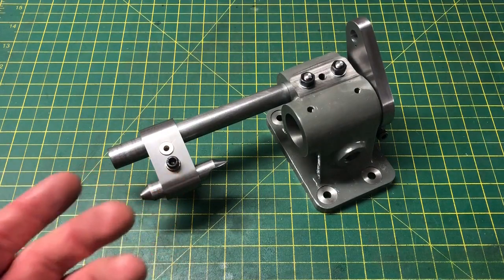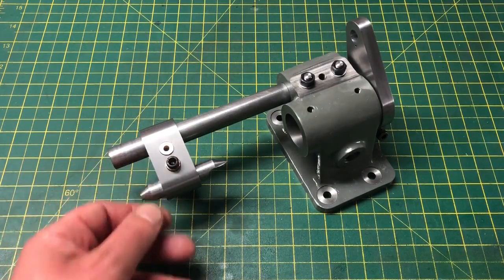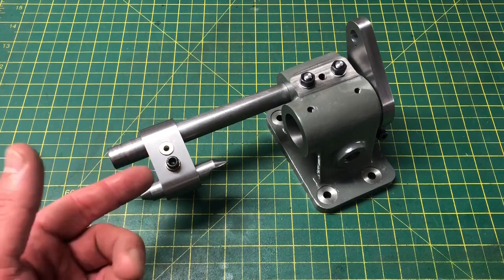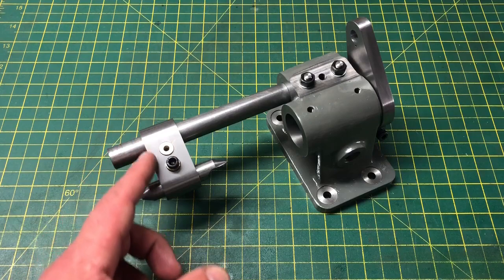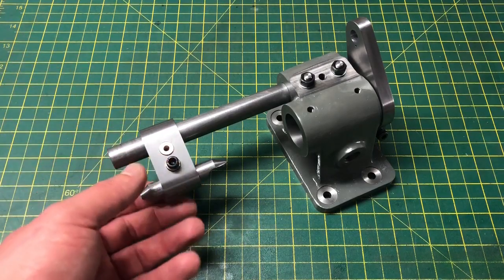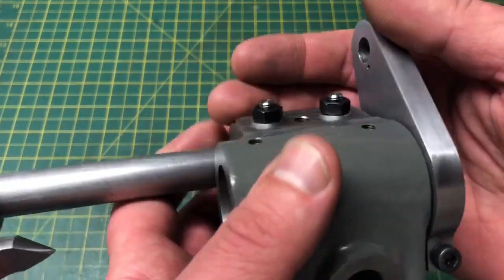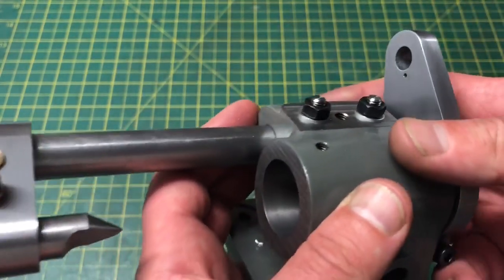We are back at the bench for the final time today, and I have put together the head so far. All of the parts move as they should, all of the locks work nicely, and mean that the parts don't move when they shouldn't. I haven't gone too mad with the surface finish, but I have touched all of the edges with a stone, and hit any parts that needed it with 240 grit wet and dry, just to take out the worst of the milling marks. Off camera, I have evened out the lengths of those two cotters, and I have also just touched up the paint on the main casting with a brush.